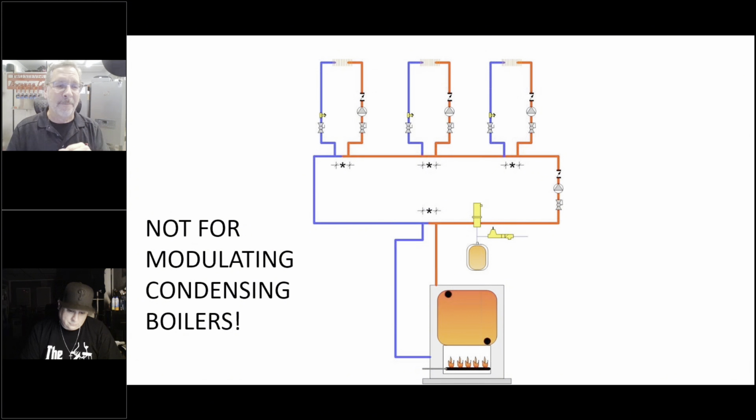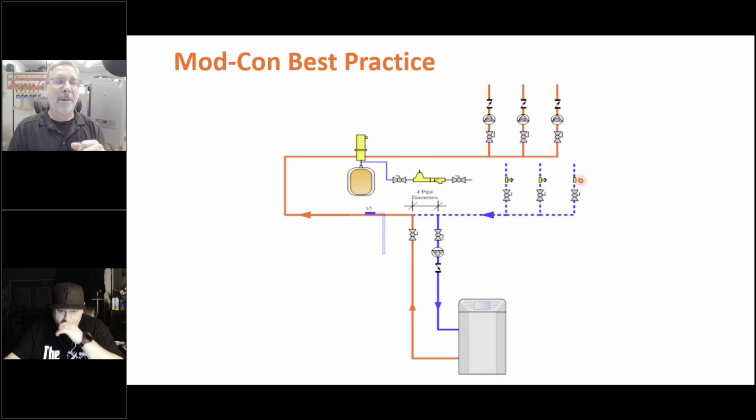Because in a condensing boiler, we no longer have a primary loop because we don't need to protect the boiler because we want it to condense. So we don't have a primary loop on the boiler. So now you have a circulator for the boiler, a circulator for the zones, but there's no more primary loop here. You see how that works? On a single boiler or dual boiler or eight boilers, we have all sorts of ways to do it, but right here in this application where we have no domestic hot water going off this boiler, this is working just fine on straight out moose antlers, right? Moose antlers, two T's coming up from the boiler and off we go.